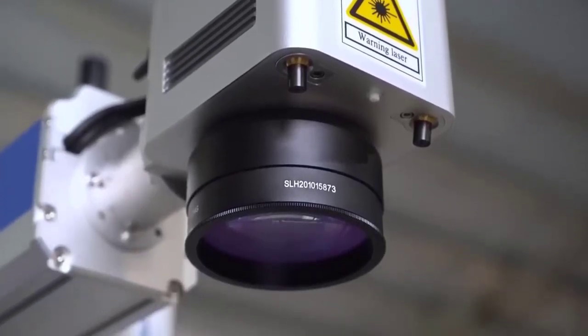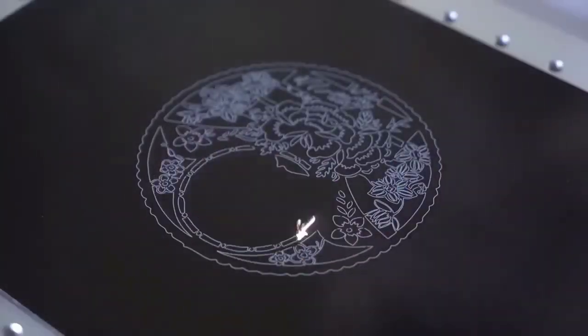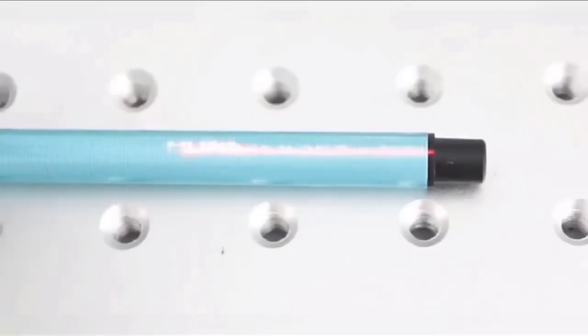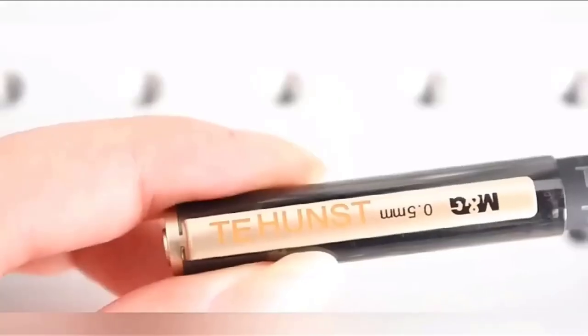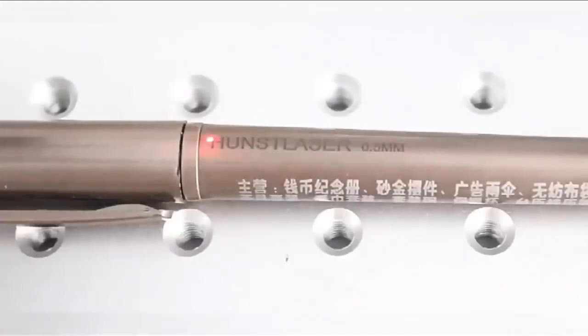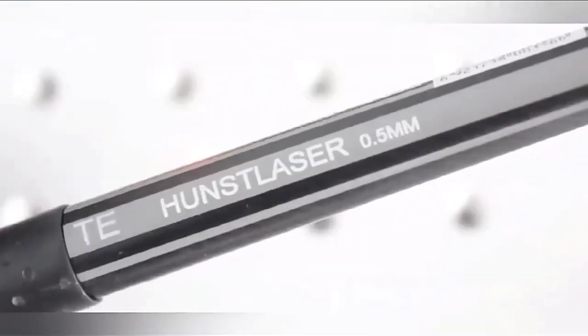The machine's ergonomics, appearance, and design are made to match the extensive functionality of the laser marker. Laser marker emitters are equipped with an intelligent system of air cooling, which is activated only when necessary. As a result, the machine works much quieter. Laser emitters allow you to achieve an increased number of colors, as shown in this example of color marking on stainless steel.